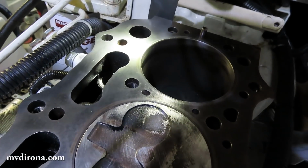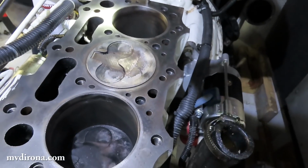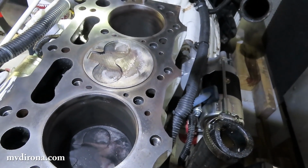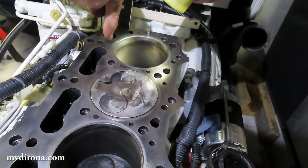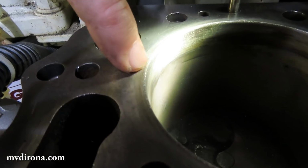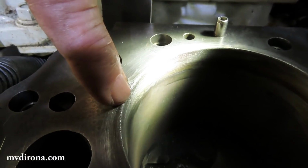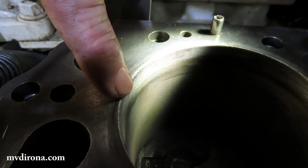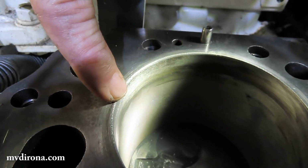Just as on the cylinder head, we had a buildup of carbon, and if you dig below the carbon, you'll find rust. Not serious rust, not a lot of rust, but there is a little bit of rust, which makes me kind of suspicious. If you look very carefully right here, you see little tiny bits of rust damage. Oh, interesting. So pretty much for sure, this engine has had some water in it at some time in its life.